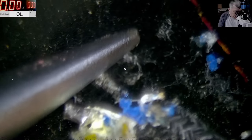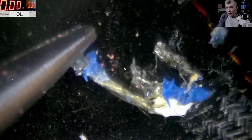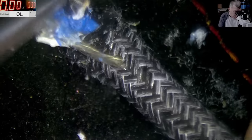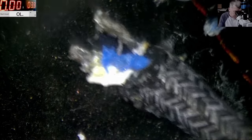This is white and it's solid. This is black and it's solid. And this is blue and the blue is broken, you can see. So we just found this charger issue. You see the blue wire was broken around here, exactly where the cable is wiggling.